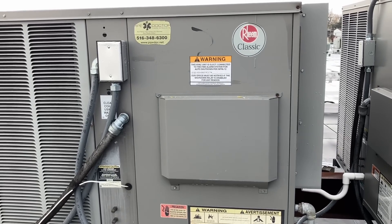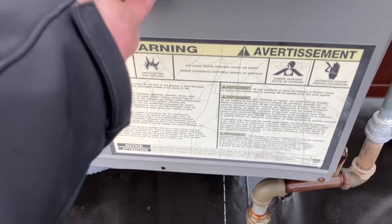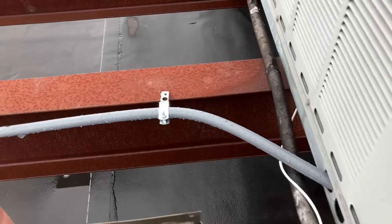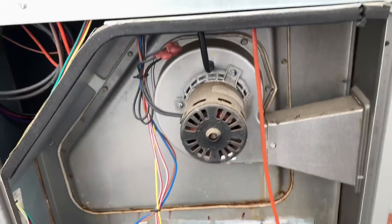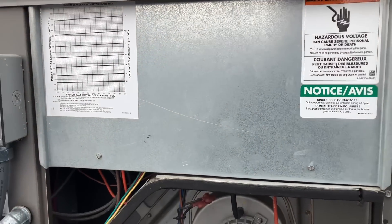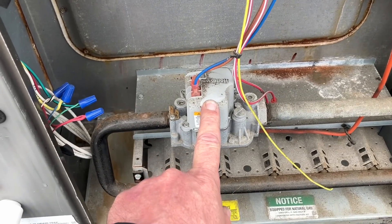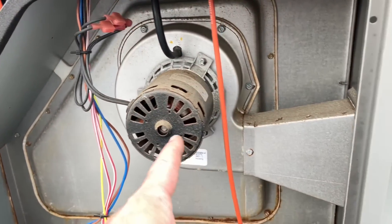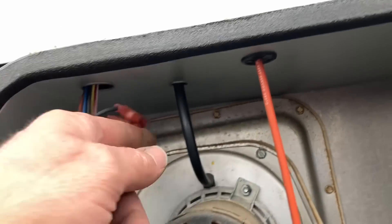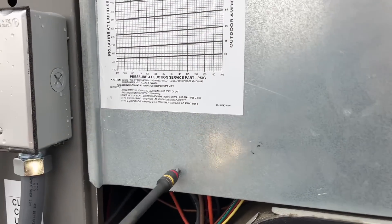They've got no heat — the thermostat is set for 70 but it's reading 62 in the barbershop right below us. Let's go see what's going on. I removed the three screws in the bottom. Our electric and control board is behind there. Let's quickly look at everything: our Honeywell electronic ignition system, a rollout switch, spark igniter, the inducer assembly — it vents out there. Quite simple pressure switch tubing. Let's open up the next compartment.